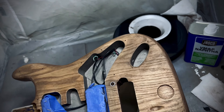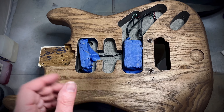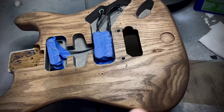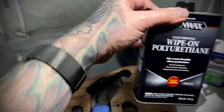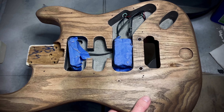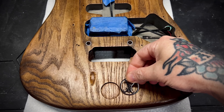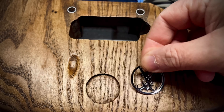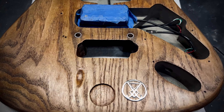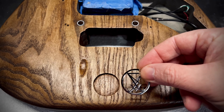Overall not too bad — I'm not 100% sold on the color, but worst case I'll just strip it down again and refinish it at some other point. The next step is to use Minwax wipe-on poly because it has a satin finish — I'll do a few coats of that and let it dry. The body is all sealed now and I'm going to put in the sigil, drop it in there, and use 30-minute epoxy so it has plenty of time to level out before it sets. I'll use a little syringe to fill it.